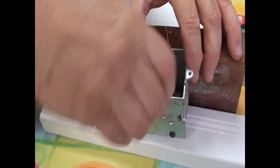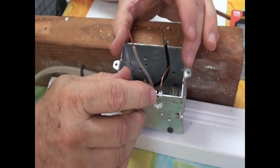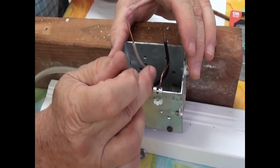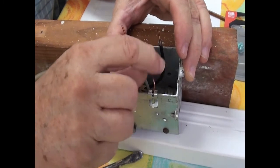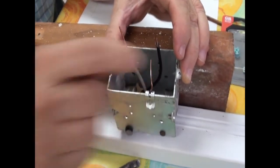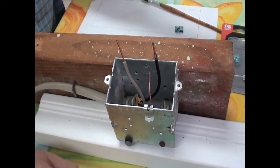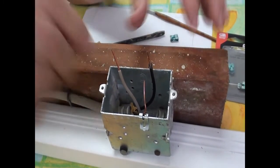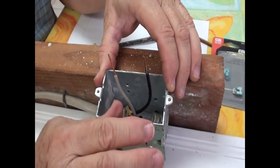You can also keep this wire intentionally long, because if you're using a switch that has a grounding point or a receptacle with its ground, you can use the pigtail here and connect that directly to those grounding points. And I hope that adds a little clarification to how to use these clips, how to install these clips, where the existing instructions are not very clear.